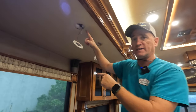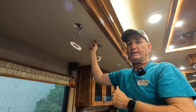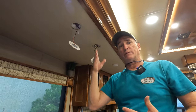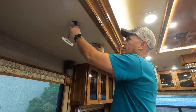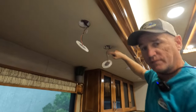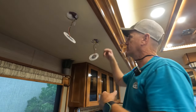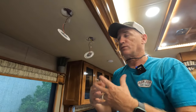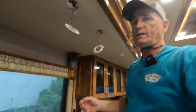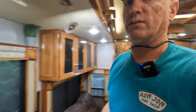We did run into a little bit of a snag. These wires are daisy-chained across and this wire was super short — as soon as I went to strip it, it pulled it through from one hole to the other. That was a pain to re-fish through. We just used a metal clothes hanger, taped the wire to it, and pulled it back through. Also, if you strip these wires down a little further — about a half inch instead of a quarter inch — it makes it a lot easier to tie the wires together and crimp them.